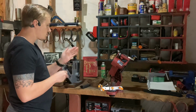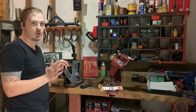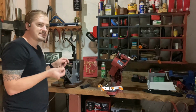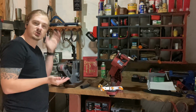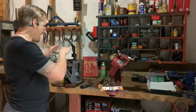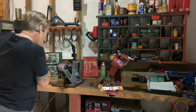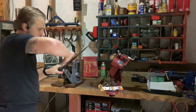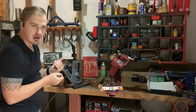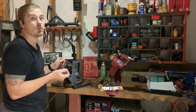I used to do the ceramic where I would do a pass on each side. Knocks off the burr stupendously quick. But it's not as reliable and not as consistent for an edge is what I found. So it's the reason why I changed to doing what I do now. It takes a little bit longer, but it's better than back and forth and back and forth. So it would be back and forth, and you're just teasing that burr to each side. And then eventually, it just pops right off as little flakes, or even you'll sometimes get a little wire that basically comes off, thusly wire edge.